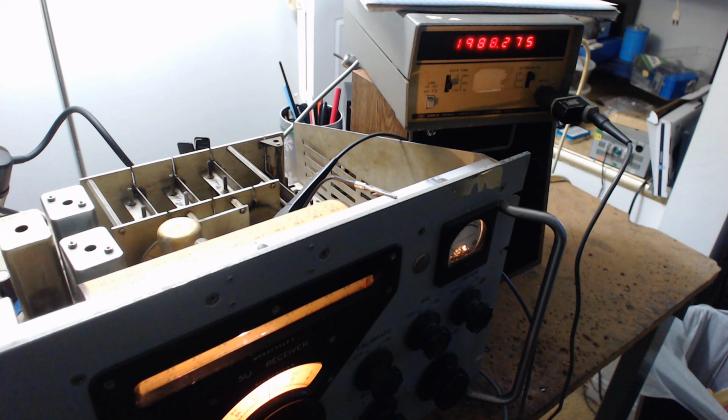Just to get it in your mind that no matter what band you're on, the local oscillator has the same range because they've manipulated the frequencies down using mixers. So they fall in a certain range that now you only need a certain range local oscillator, which they call a PTO, permeability tuned oscillator. And they move the frequencies down, mix them down, so now the same oscillator is used on every band within that range. It always has the same range, and it's slick. And that's what I wanted to tell you.